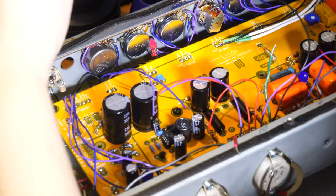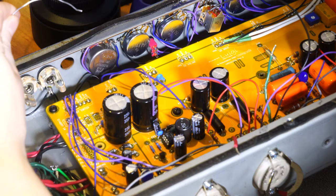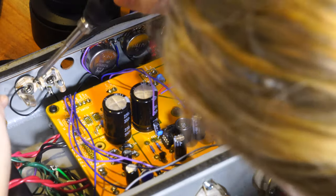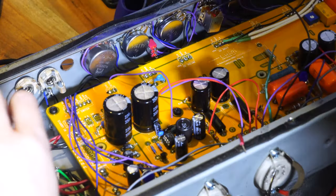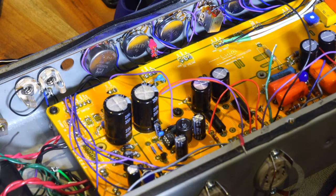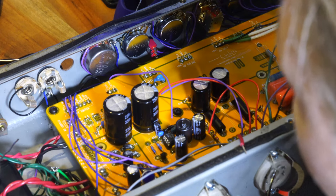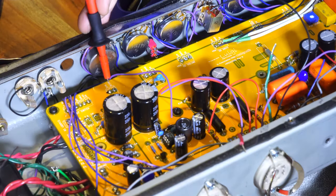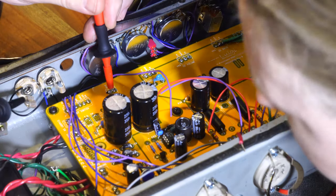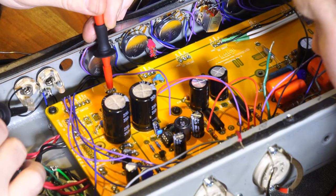So, all right, got to solder a second line. Then when she gets the grounds reference, she can connect the two to the tips of each of the other two, the send and return. Okay, and I think it looks like I've got it to both sides. Yep, looks like it's rolled up. And we can actually test that by doing continuity between the point here and the tip here right now. And it works.